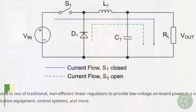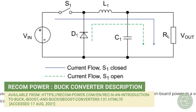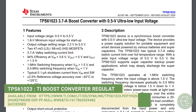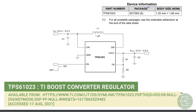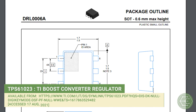Another way to think about that is: when switching the inductor in a buck converter, when the output voltage is equal to the input voltage, you can no longer produce current in the inductor because the voltage across it is zero — meaning you are no longer able to effectively convert power. So we've implemented a TPS61023 boost converter regulator. This chip integrates all of the switching elements, the controller, and the gate driver into one convenient — and might I add tiny — package. For something this small, we can only expect to get maybe an amp or two when the regulator is really dissipating power.